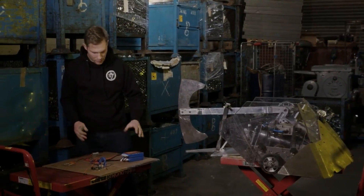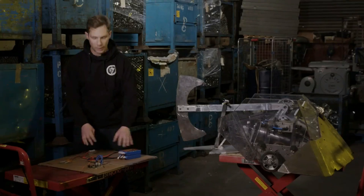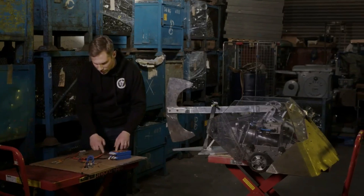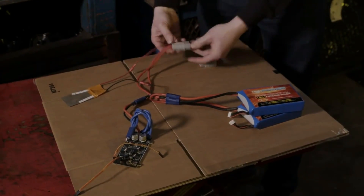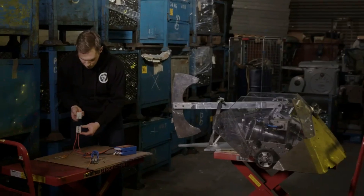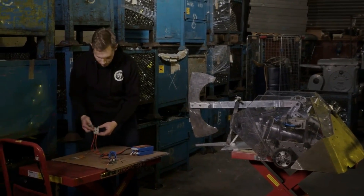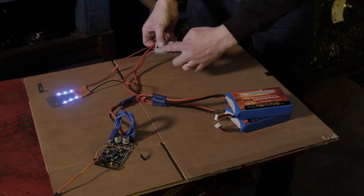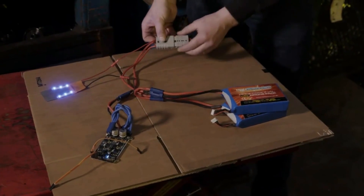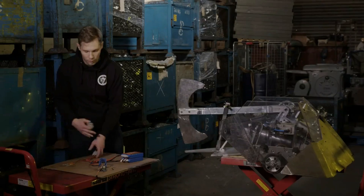Here we've got our batteries — this is our power source for the robot. We have positive and negative coming out of the batteries. The negative goes to our components, and the positive is fed off over here. The positive comes out of the battery, and we use this removable link to connect the power back up so it goes back down to the components. When I plug this in, the power comes back through here, lighting up our power lights and arming up the components. At the end of battle, we can pull this out and the robot will die — no more power goes to the robot.